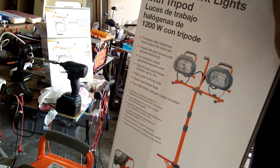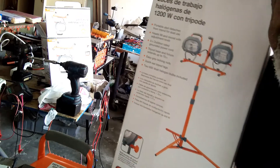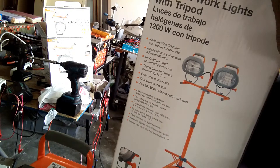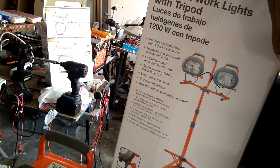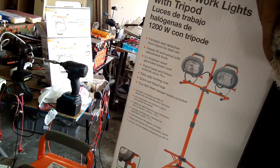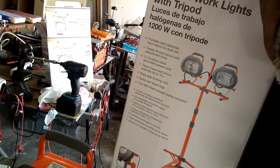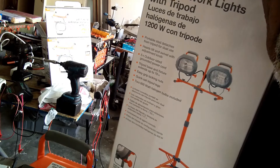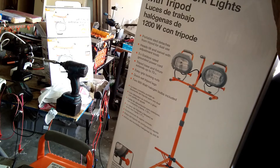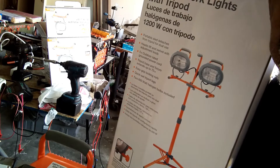I prefer the 600-watt light because it's not too powerful but can do a good job. You don't want to discharge the battery too quickly — you want to discharge it a little slower, but still be able to discharge the whole pack in one go. The 600-watt light may take a little longer but it will discharge evenly and will not heat up the pack. With the 1200-watt light the pack gets hot and you'll have to wait for it to cool down before charging.